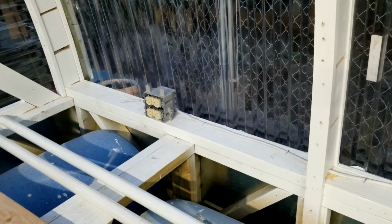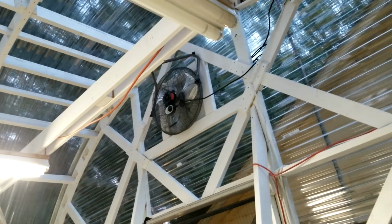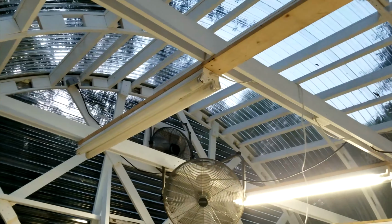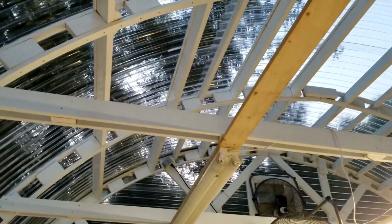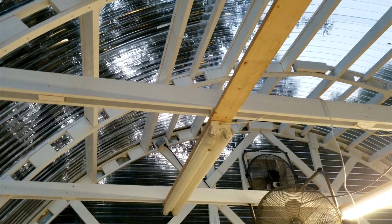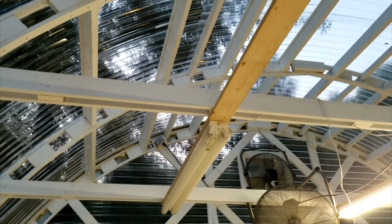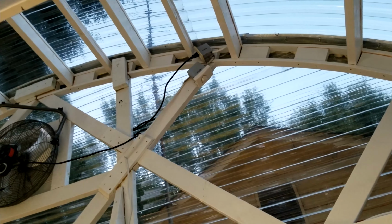On the other side over here, where I'm going to have mostly aquaponics, I got double plugs going down the side. We got 2 exhaust fans, one there and one down there. Now what I've done is leave the plugs on, because I consider them replaceable. This way the next fan's plug and play. Then that plug goes to this plug, and right below there is my attic fan thermostat, which I have set at 100 degrees.